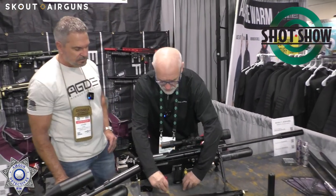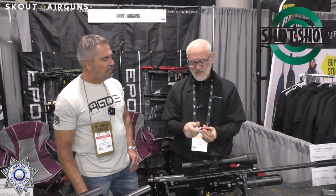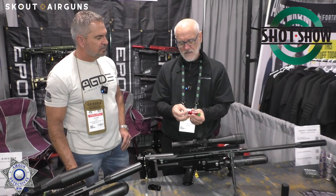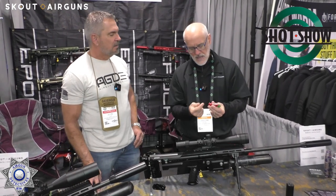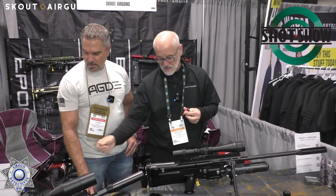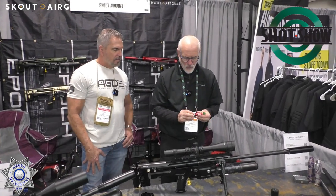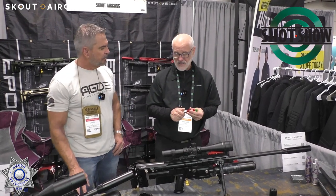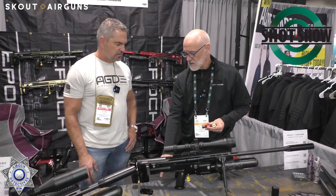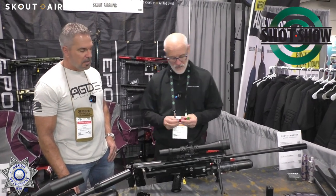From a standpoint of dealers and quick servicing, these are cartridge regulators. Basically, if somebody needed the gun fixed, there's a hex key for a socket cap in here, and you can screw the whole reg out, screw another reg in, and you're good to go. Same thing with the valve system. So it's a very simple gun. Many people have worked on air rifles before, and on some air guns it could take 25 to 30 minutes to get into the valve. Without a doubt. On this gun, three screws, and then you take off the transfer block with four. I'm into the valve in 3 minutes. Unbelievable.